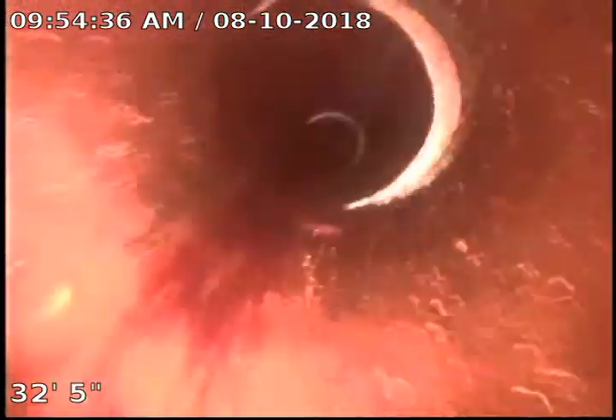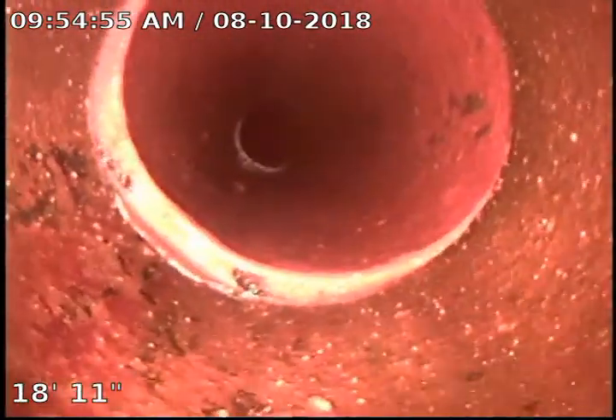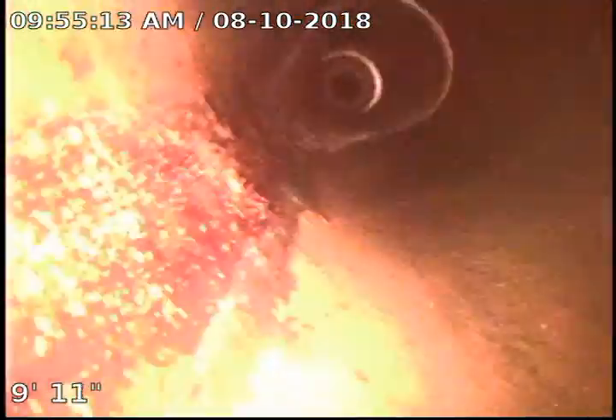All of this was jet cleaned — the biggest spot was just right where it exited the house, there was a big clump there which we were able to remove. It was already in really good shape to begin with, but it's amazing how much it cleans up when you run the jetter through. We used a special head called a warthog head — it has a controlled rotation so it cleans the entire inside of the pipe. There's our reducer again, going from four inch cast iron out of the house to four inch clay, and then four inch clay to six inch clay.